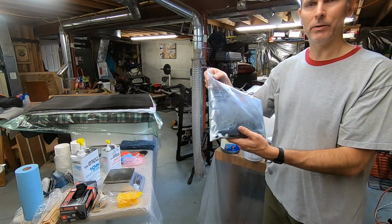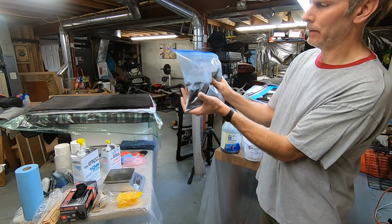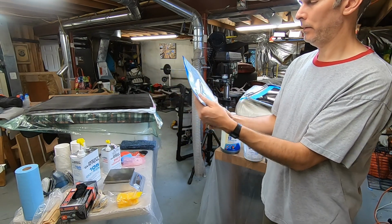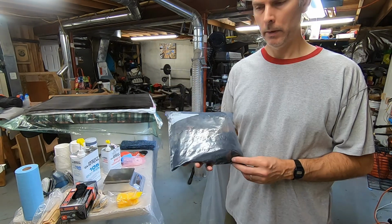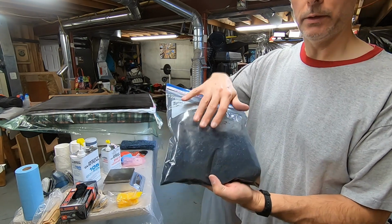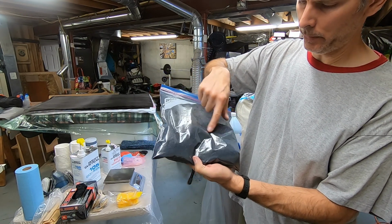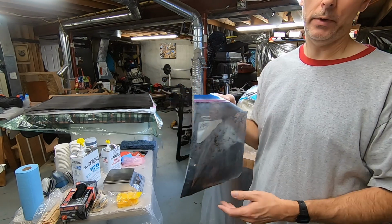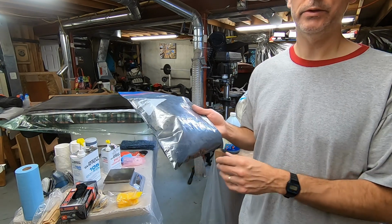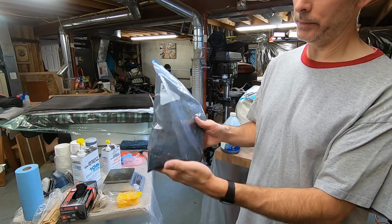But this is really kind of a strange powder because it kind of flows. The Cabosil is so light, and you really don't want to be doing a lot with it outside of a closed container. So I've mixed up this Cabosil and graphite powder in the bag, and as you can perhaps see, there are little white clumps of Cabosil that I don't like to mix in, but when it's mixed in with epoxy, this should go away. Again, the pre-mixing is just to prevent any streaks, so that basically we're starting with a consistent color.